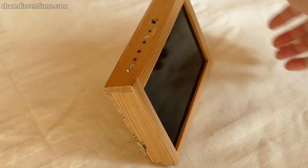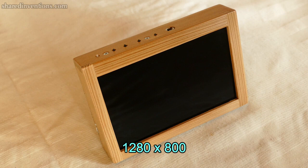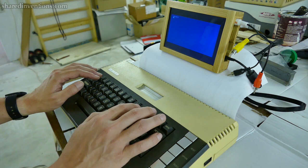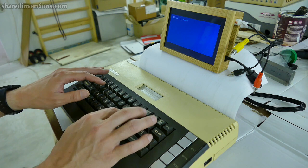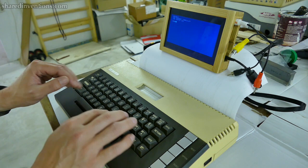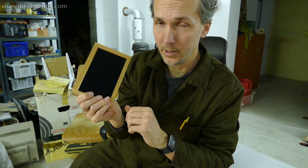This particular screen has a resolution of 1280 by 800 pixels and features HDMI, VGA, composite video input, and a DC jack but no audio. Note that in this video I'm talking about internal batteries, but in real life it turns out that some HDMI video modes draw a power the battery management system cannot handle. I spent hours and hours to find a good solution for that, but in the end I was stuck with the DC jack for situations like this. So let me just show you how I've built this.